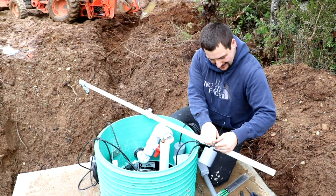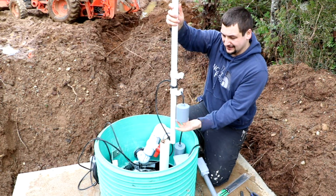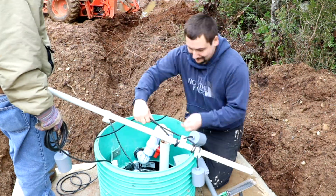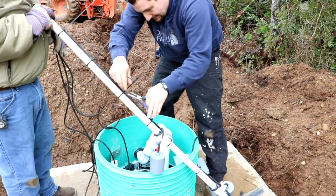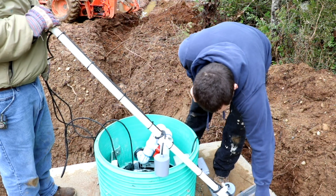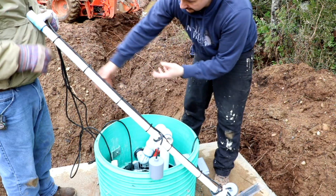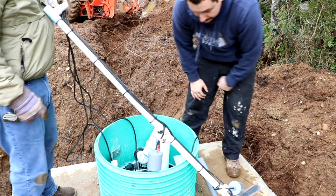These adapters have a little crimp on them which you just put the float through, making sure the wire is not twisted up. The float slides through and then you snap it down, making sure to engage the clips. Then this will be in the tank — water comes up, disengages and re-engages. So that's the float tree: you've got your operating distance, your low level emergency shut off, the redundant off, and the low level and emergency off is attached to the pump. We'll coil all this extra cable up neatly to the side so that if we ever had to work on this we have enough extra cable to pull the entire float tree out of the tank.